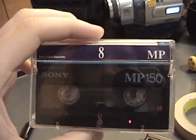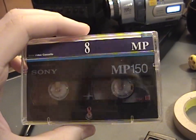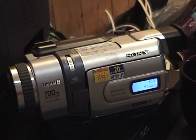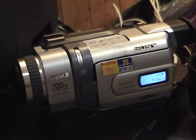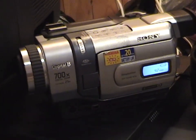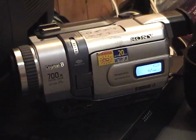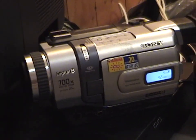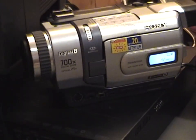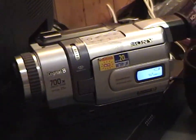I think I've found a way that I can recover this damaged recording as best I can. The nice thing about Sony Handycams is they have a built-in time-based corrector. A time-based corrector is something you find on high-end videotape VCRs — not just camcorders like this one, but also on many Super VHS VCRs, maybe even some really high-end VHS VCRs. Any high-end videotape machine will normally have a time-based corrector.